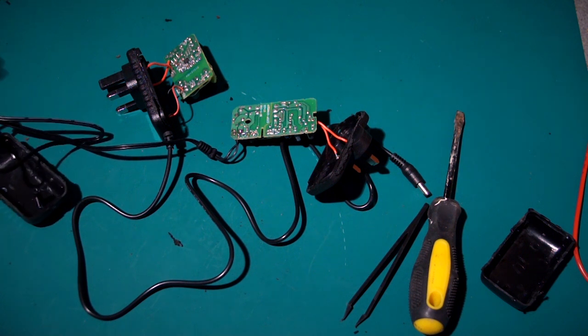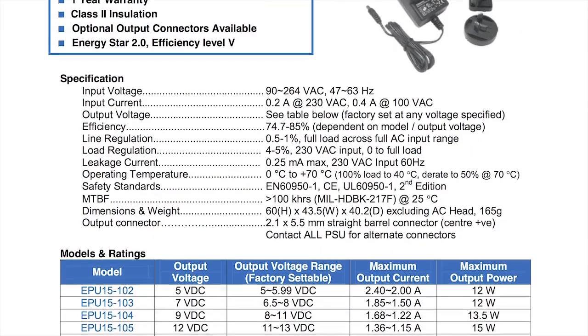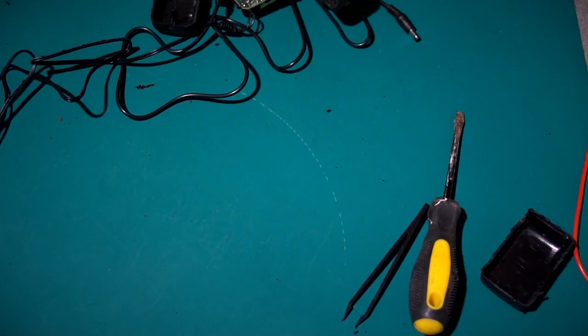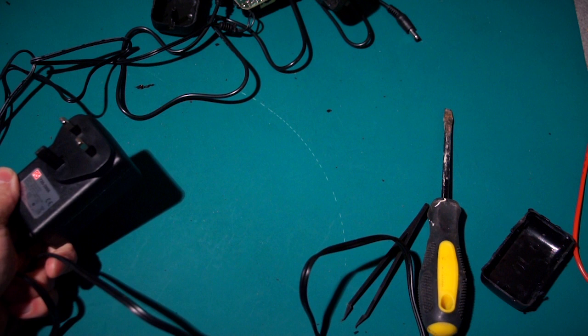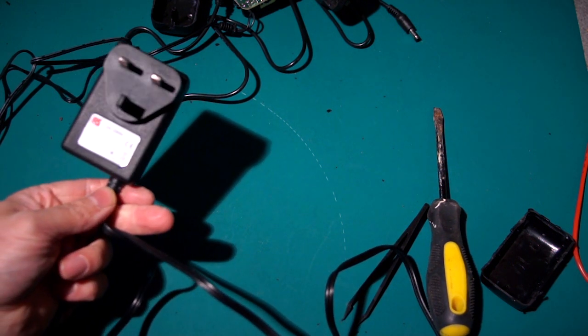So what you need is a power supply from a supplier you trust, that has a data sheet as well. And the one from Future 8-bit has a data sheet. I've shown it already. I'm going to put it up on screen again. And look, if you don't want to go to Future 8-bit to get one, you can go to someone like RS. And this isn't a 9-volt supply, and I don't think RS actually sell one with the correct polarity for a Spectrum. But my Amstrad and some of my other machines run on RS supplies.